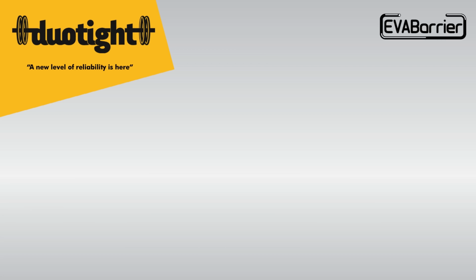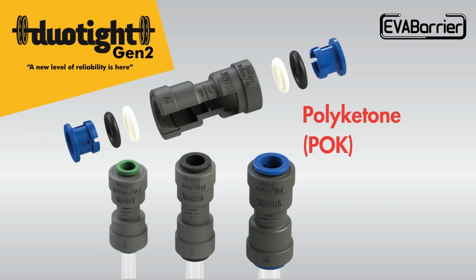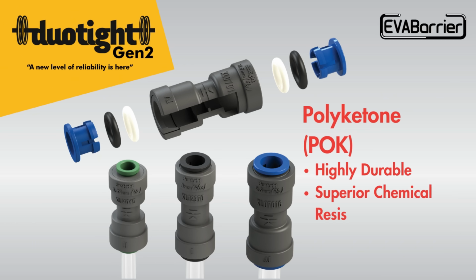that we've got available. Now, before we go too much further, I also want to say we've done major upgrades to the Duotight fittings in general, which is a change happening across the board, and we're switching everything over to these new Gen 2 fittings. So what that means is we're now using new polyketone resin in all of these new fittings. And the polyketone has better chemical resistance. Previously, we used acetal, and that's currently what John Guest use, and maybe some other manufacturers like DM Fit. However, we've found the polyketone to be a much better plastic because of its durability and high chemical resistance, and now they've also brought out a new UV grade. So you can even sit these out in the sun. I've been using some for garden plumbing, and they work really well for that application.